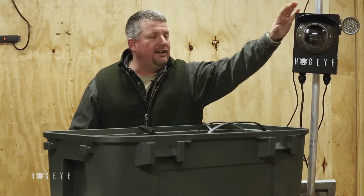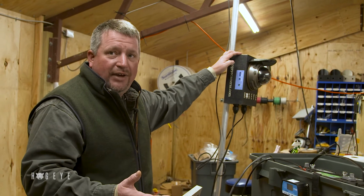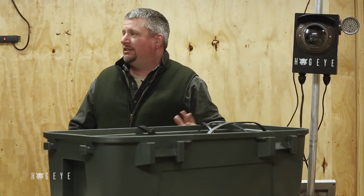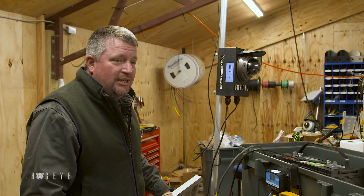then a signal strength. Now, this unit is going to take 2 to 5 minutes to power up, find a tower, start talking to the tower, and then say, okay, the last thing that'll come on is the carrier light. Hey, we're talking to the right tower, we're dealing with the right cell phone company, we're in good shape. So we're going to let this kind of power up. We're inside, so it's going to take it another minute.